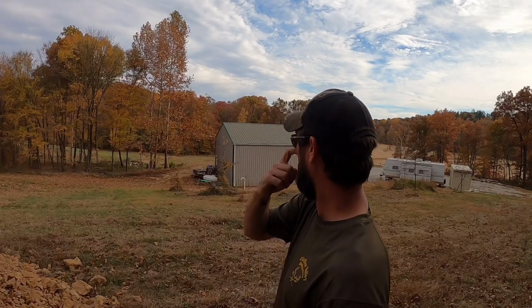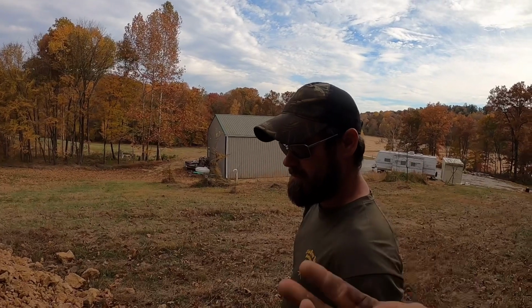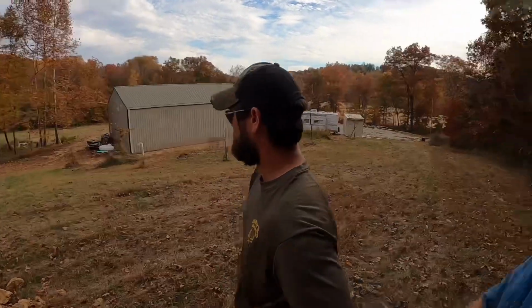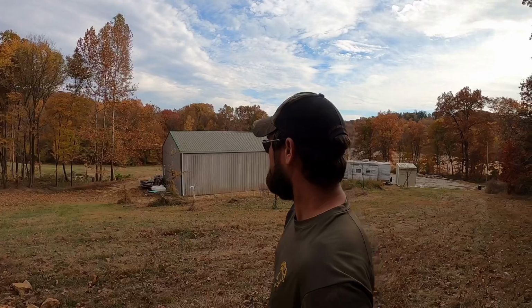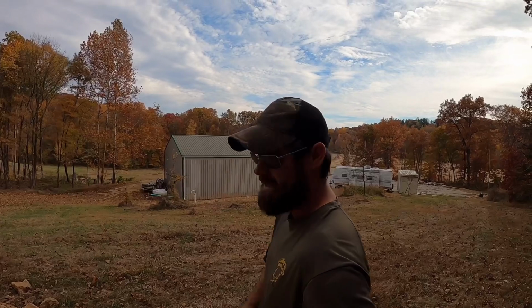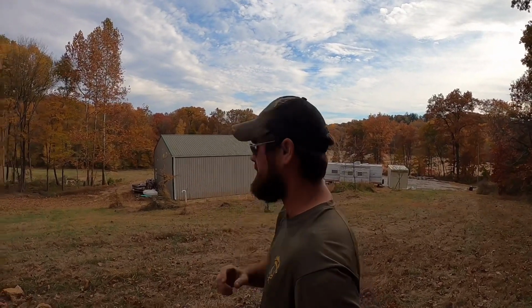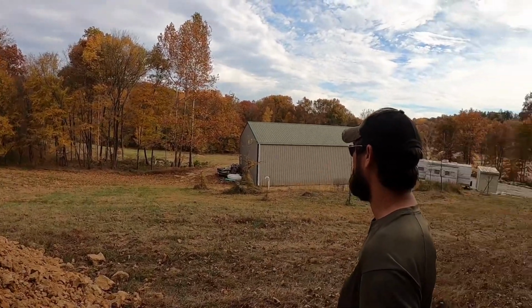Now, what's completely different about this job than the previous one is the quality of dirt and the amount of dirt available. We have no limitations on septic. Well, we do have a septic over there, but it's not crowding us near as bad. No. We got a lot more elevation changes here, which means we got to move a lot more dirt to get the same volume of water. Correct. Same surface area of water, I should say. And this is going to be probably the 850J, 210, and Bubba Dump, and D4. And skid steer. And skid steer. That's what I have. And on the other job, we probably will not have Bubba Dump on that job. We'll probably have two 850s on that job. Agreed. I'd say both of them. This one here is probably close to a 2-week job. The other one's probably about a week and a half.